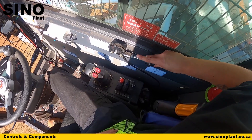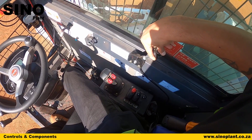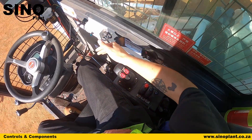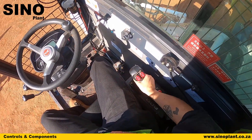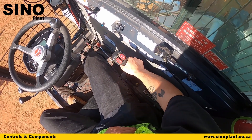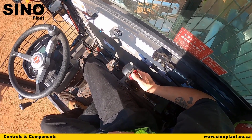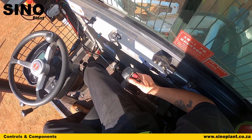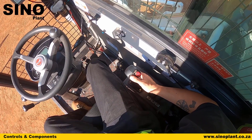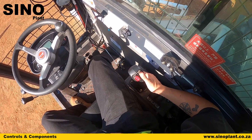To operate the manual accelerator: pull the button in as you lift it up, your engine revolutions will increase and stay there until you drop it back down. Your joystick is for the lifting bucket on the front — lift by pulling back, drop by pushing forward, curl the bucket up or down. There are two toggle switches: one opens and closes the door to offload material from the lifting bucket into the drum, and the other switches the vibrating motor on and off.